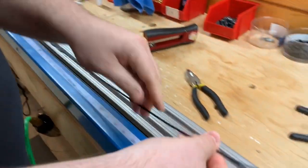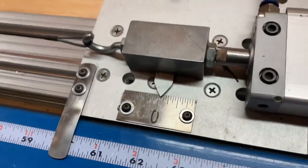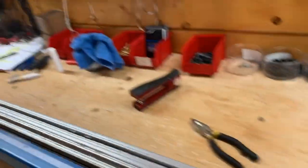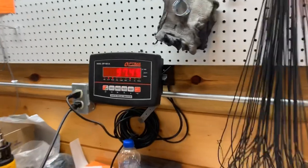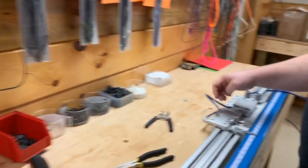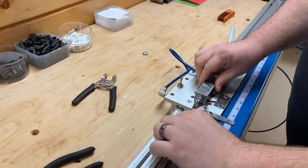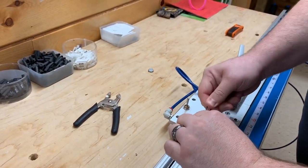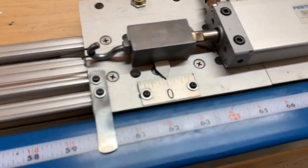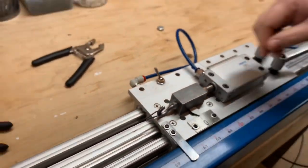We'll put it on one hook here, another hook there, and then put it under pressure — up to a hundred pounds. We can see this string right now is coming in a sixteenth long, and it reads 97.3 to 97.5 pounds. The difference between 97 and 100 is not significant, so I'll take the pressure off and put in about two twists. Now, as you can see, that length will be exactly on.